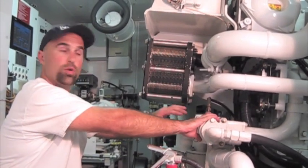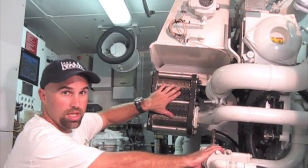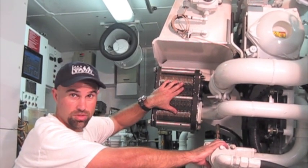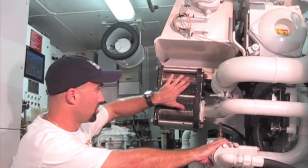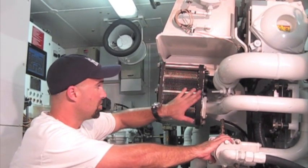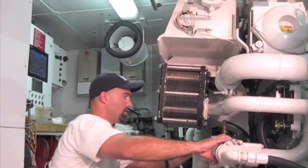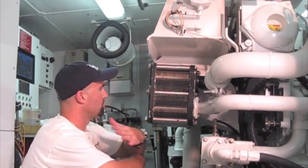The engine has its own cooling system, separated by what's called a heat exchanger. There are actually two other heat exchangers on this motor — three of them. Sometimes they have four different heat exchangers for the oil, fuel, and air — all different types. This heat exchanger here is for the engine water coolant, so the seawater pumps through here to cool the engine coolant. Then the engine coolant is pumped throughout the engine by another pump, so the two exchange the heat.